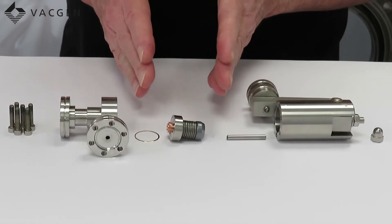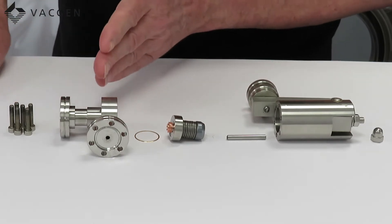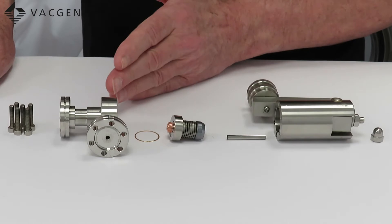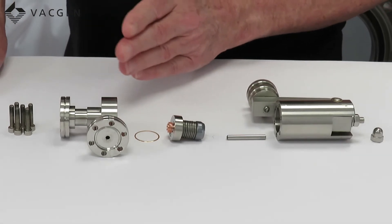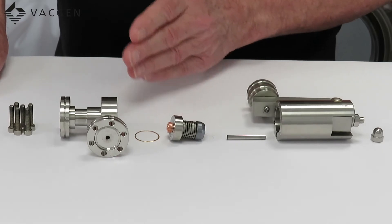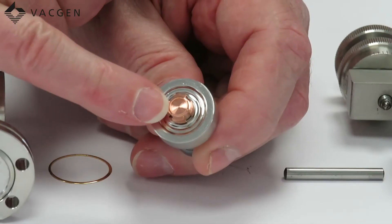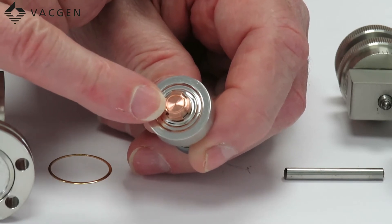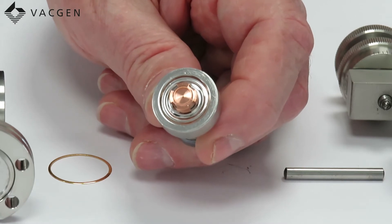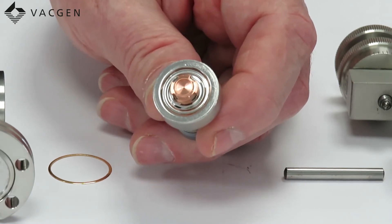These small washers balance the pressure of the pad loading against the sealing face. The pad never actually leaves the sealing face — all you are doing is releasing the pressure of the pad to create a gap where the molecules will leak past. The raised part you can just make out is the sealing area that seals against the body inside. There is no sapphire in this, so there is no way this valve can fail catastrophically.